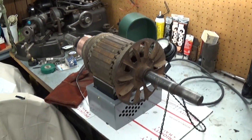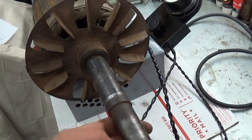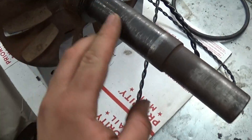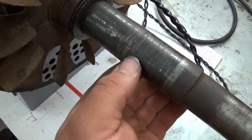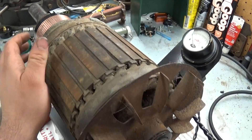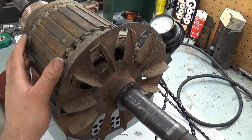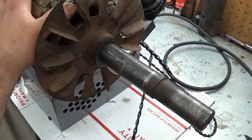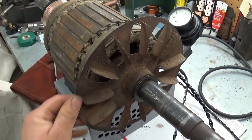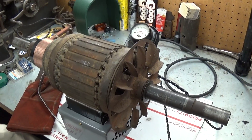I hope this was informative. I just restored this thing and got it all cleaned up over the past couple days because I knew I wanted to start on this generator project. You can see that the shaft is really in bad shape — I'm going to have to turn this down and make new bearings for it. And the commutator has some wear in it, so it's going to need to be recut. Before I put too much money into it, I wanted to check if there were any shorts or electrical issues before really getting moving on this project — to assess whether it was worth doing. This armature passed, I'm happy, and I hope you enjoyed the video. Thanks for watching.